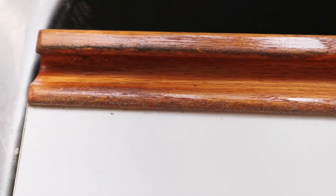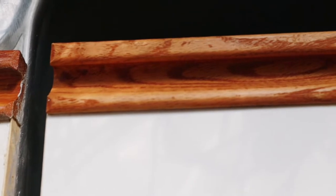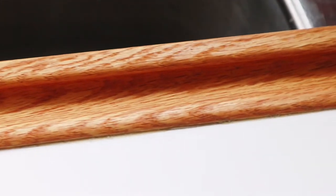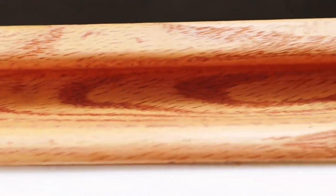You can see the difference clearly — this is a cabinet door not yet cleaned versus one that's done, and this is about as close to the original look as we're going to get. It was nice and clean with no more dirt and grime, so the yellow won't show through when you paint. It's also really important that you use a proper primer — a really good brand name one. Don't cheap out on something like this.